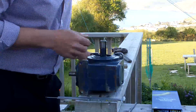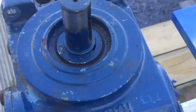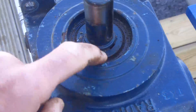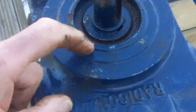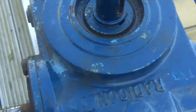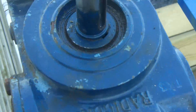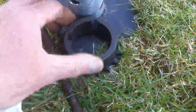I simply don't have the facilities. You can see there's a keyway in the bottom part, and the way I'm going to be using this, that would introduce water into the mechanism. I wonder why on earth they left that open like that. I'm going to be using this worm drive this way up, and there are sealed bearings but there's an opening there — just something I need to be aware of.